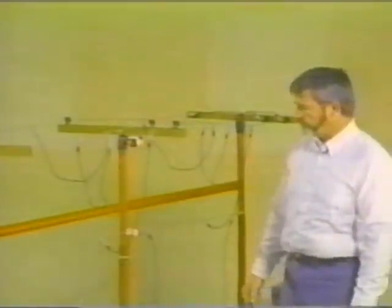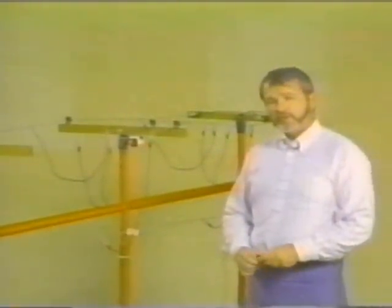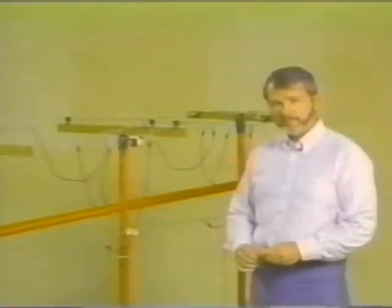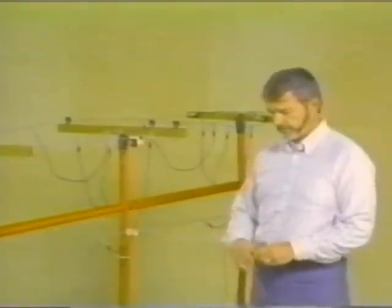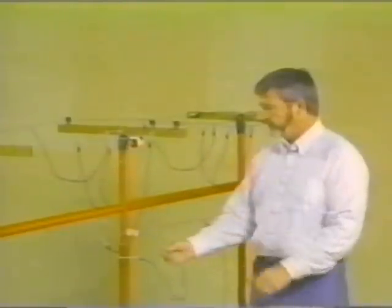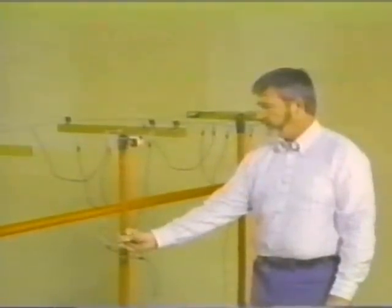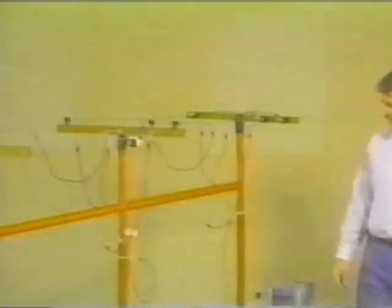So how are we going to protect this man? Let's come to the work site. And we'll install on the structure where he's working a grounding cluster bracket. We'll let this little spring here be our grounding cluster bracket. And from that grounding cluster, we will attach a lead no further than the neutral. And let's re-energize again.